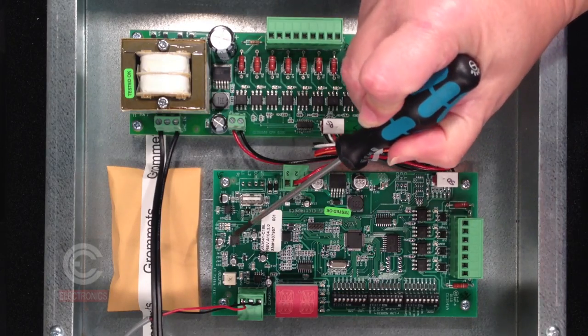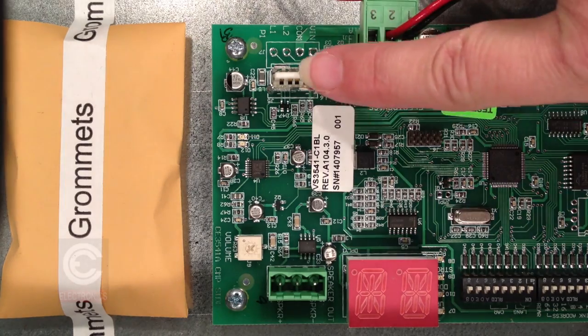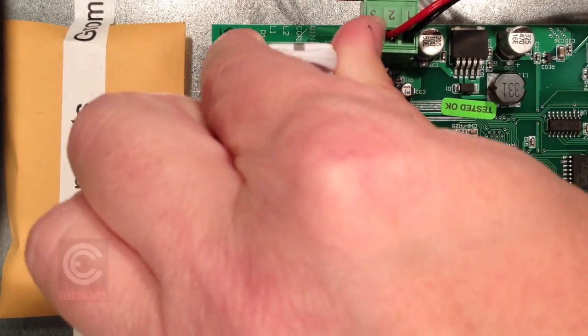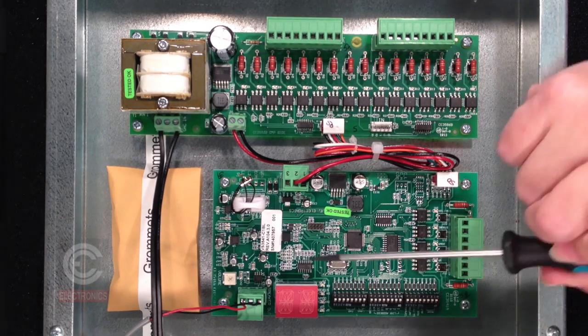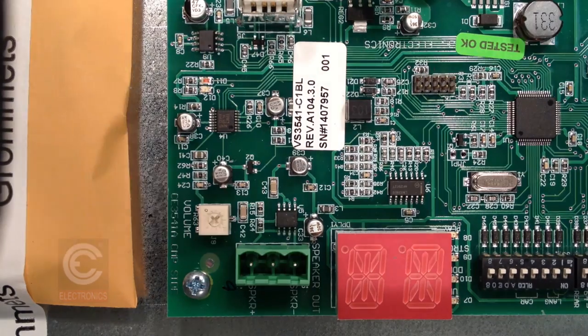In this mode, the green status LED D12 should be blinking. Plug the USB stick into the USB connector J5 on the unit. When the unit detects the stick, the green status LED will go out and the red status LED D11 will begin blinking slowly.